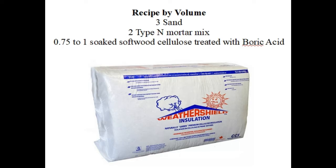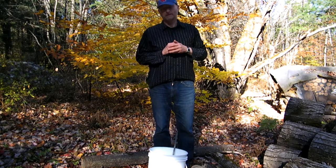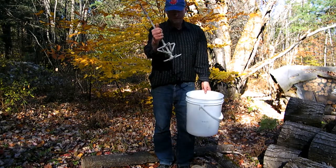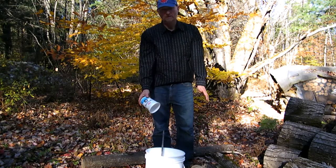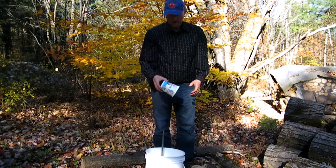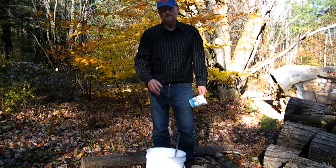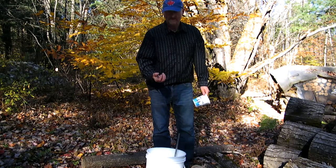The mix should be just stiff enough that it stays where you tell it to, and a ball of it would hold together in a plaster fight. The lime is what makes the mortar so smooth and well-behaved to sculpt, and it also imparts a self-healing property to any cracks. Do not use a cement mixer — it's awkward and takes time. Much better to just use a bucket and essentially an egg beater on a drill. Add in your water first for bucket release, then add in all your mortar, then throw in about three-quarters of your aggregate. Mix it up — twenty seconds and you will have a perfect mix. Add in the rest of your aggregate and you get a nice firm consistency in another twenty seconds or less.